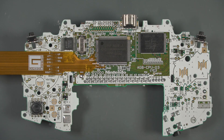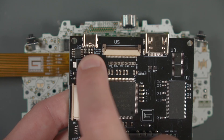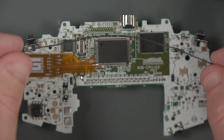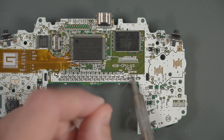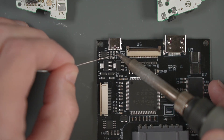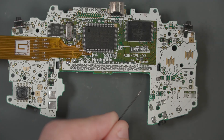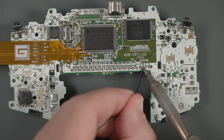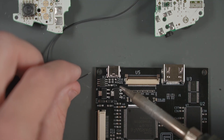There's only one more thing we need to do before we can assemble our GBHD Advance. We're going to need to solder a wire from the S2 pin on the cartridge slot of the Game Boy Advance motherboard to the bottom right pad of the R16 resistor on the GBHD board itself. I'm going to grab about six or eight inches of 30 gauge silicone wire. I'll switch back to my normal chisel tip, tin the S2 pin and the bottom pad of R16, then strip and tin both sides of our wire, add a little liquid flux to S2, and solder the wire to it. Then we'll grab our GBHD board and solder the other side of the wire to the bottom pad of R16.